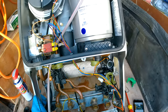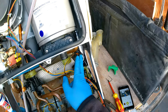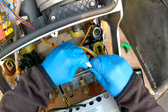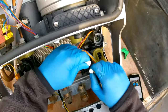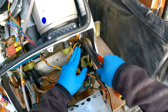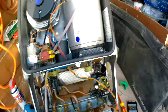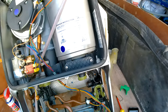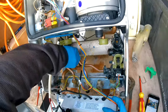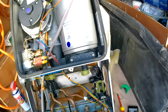That is the pump body out. Now we can pop out the flow turbine — just disconnect it from its connector, grab some grips, and carefully remove it without damaging the plastic. That is the flow turbine out. Then take out the clip — you might need a flathead screwdriver to get that out.